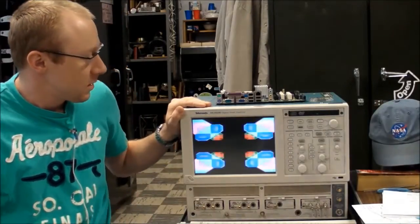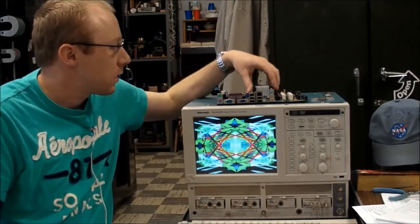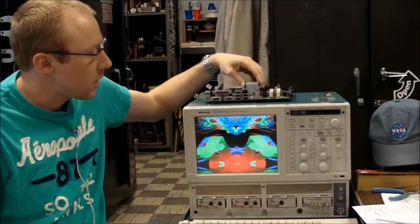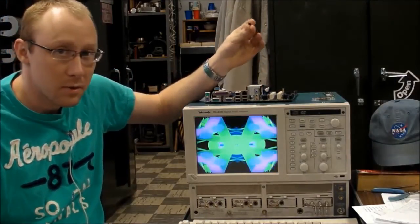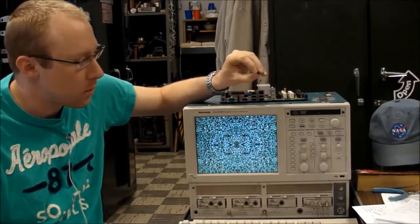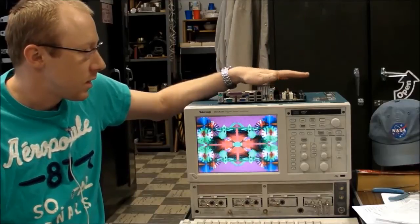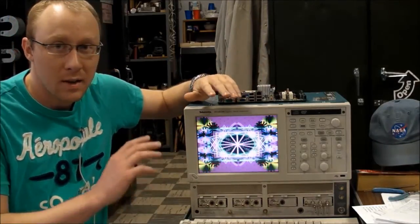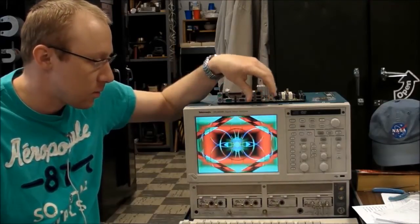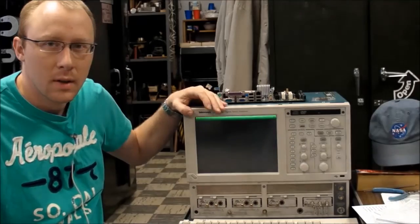I'm going to use this $20,000 piece of equipment with $30,000 worth of front-end modules and $30,000 worth of application software to run a 1993 MS-DOS screensaver called Razdaz. Check that out. When I first started out with this thing, it seemed like a power supply problem because the power was constantly cycling. I found out the problem was the motherboard, then localized it further to a bad MOSFET. I tried replacing that — it didn't work, so I replaced the whole motherboard. And of course I ran into the Trusted Platform Module problem. After I got the new motherboard in, it should have worked — but after that it was more like a hack to work around the software authentication protocols internal to this thing. I hope you enjoyed this series. I hope you learned a lot — I know I learned a heck of a lot. See you later.